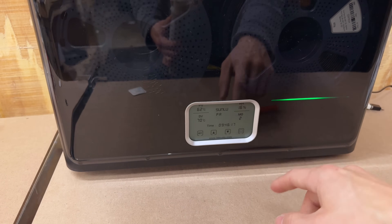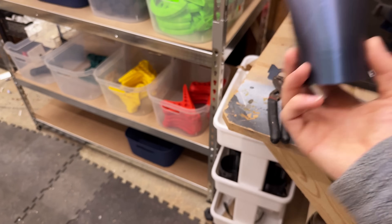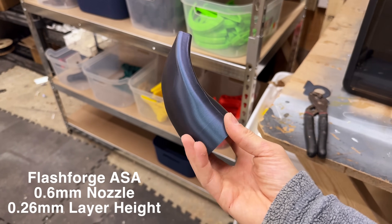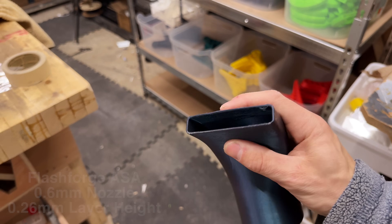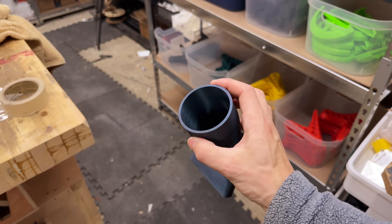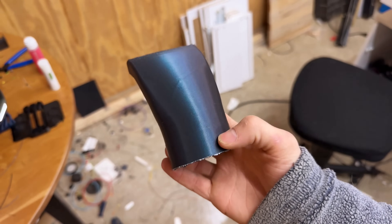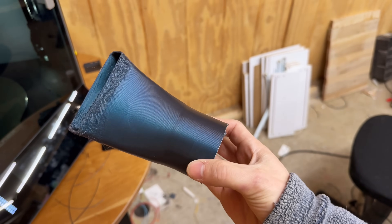15 minutes in, we're up to 62 degrees Celsius inside of there — that's pretty neat. Speaking of ASA on the S1 Pro, this was printed with a 0.6 millimeter nozzle, 0.26 millimeter layer height, and no supports. Up here where it hit the overhangs, that's a tough one, but this was first slice with no supports and no brim on this machine, and this is the quality we got from the FL Sun around the actual print itself.